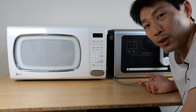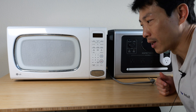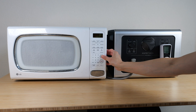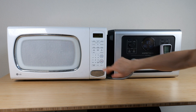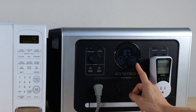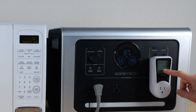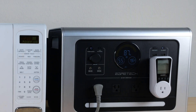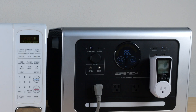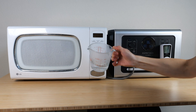When you have no power and want to cook some food, this is what you'd connect to your power bank — microwave for a few minutes and your meal is ready. Putting in some water and running it for 50 seconds. It's pulling 1970 watts and doing it just fine; the voltage stays near 120 volts. Many power stations under 2000 watts have a hard time driving a microwave, but this one handled it.